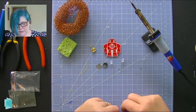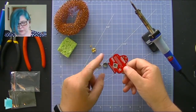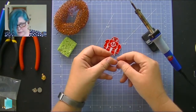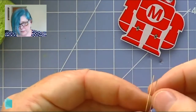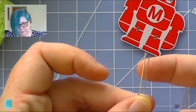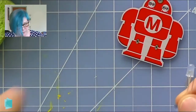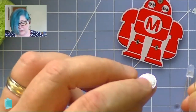The pin back and battery holder are going to attach so you can wear your cool electronics project as a pin. You want to make sure you organize your pieces so you don't lose anything. A note on LEDs: LEDs have a long lead and a short lead — the long is always the positive, the short is always the negative. That matters because the energy from the battery has to flow from positive through the circuit correctly — it's directional.